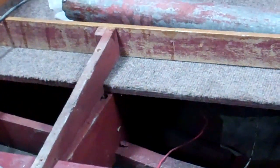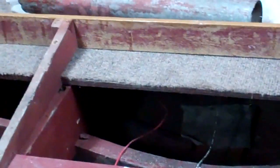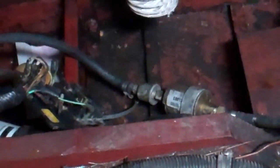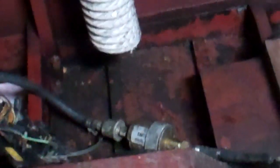As a result, we will be removing the helm station seat back completely. The seat bases must all come out. We need to open this boat up in order to clean it before we flip it over — even just to scrape it. We're going to have a lot of water and degreaser in here and we don't want to get that on the upholstery. We'll sort out the wiring behind the gauge panel, and the safest approach is: any piece of wire that's just hanging loose without a well-identified home, we need to chase it down with continuity testers and make sure it's not attached to anything.